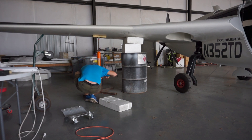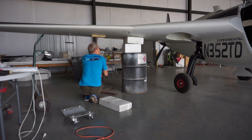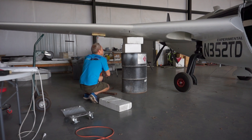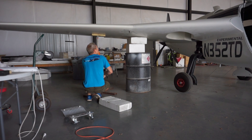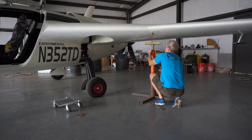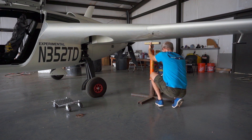We're going to shoot for a three-degree nose-up rotation initially. We're going to have Justin practice that by jacking the aircraft up at the nose so he can get an idea of the sight picture, because without a long cowling on the nose it can be difficult in a canard aircraft like this to eyeball that sight picture. We want him to have a reference point before blasting down the runway. Remember when I got the nose off that one time, it came up more than three degrees - I think it ended up being about five degrees nose up.